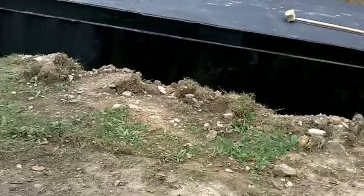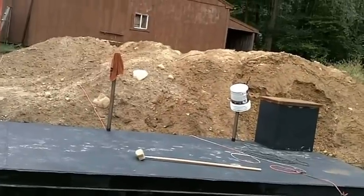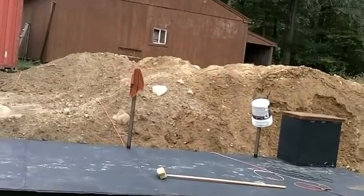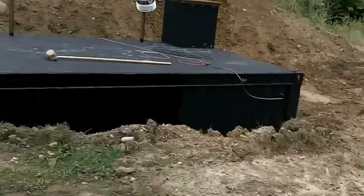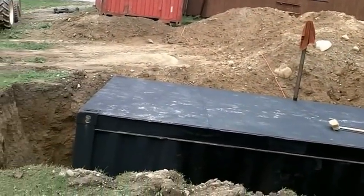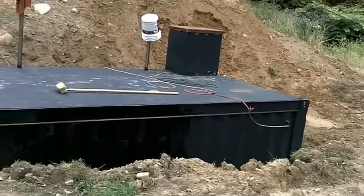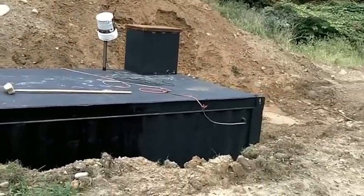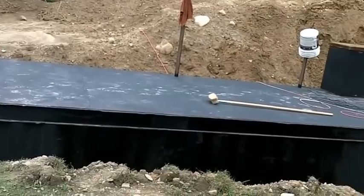It's kind of level with the ground here. With that small excavator, if you look up at that building, it's about three and a half feet up from where this is. I elected to bring it down because we were at the water table when digging. I'm going to put two foot of dirt on it — a gradual slope from the garage down over the top of this container, tapering off into the ground, so it'll look natural. The inside is dry — just like a submarine, you put it in water and it floats.